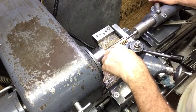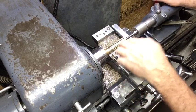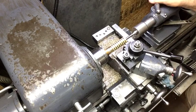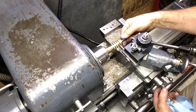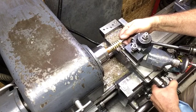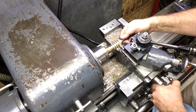But that's okay — I'm going to knurl it after I get all these off of here. They don't look too bad, look pretty good, pretty even. Now we'll just try cutting them off. So I've threaded some more and I'm putting the stud in there so I can turn this right off. The brass is pretty soft so it doesn't really take a lot of pressure.